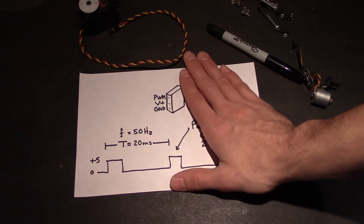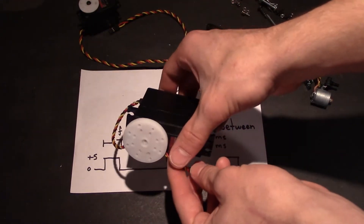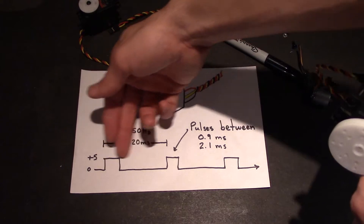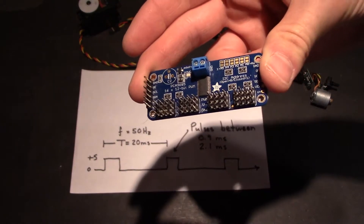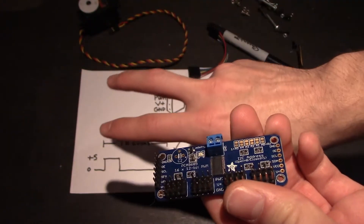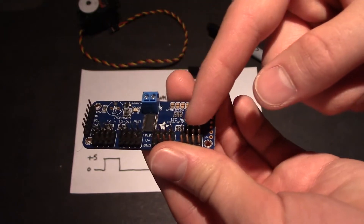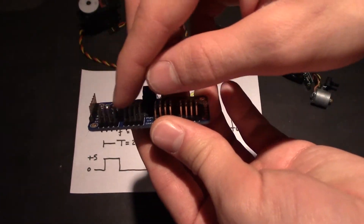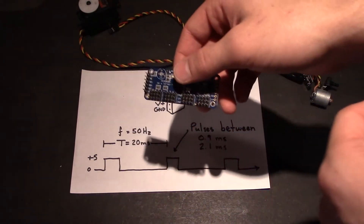The servos usually take 5 volts for sure, but some take more — bigger ones probably take more. This big one I used on my robot arm takes more than 5 volts; I think its maximum was maybe 6.4 volts, but it for sure took 5 volts. Which was handy because all our servos took 5 volts, had the same period for this pulse, and all had the same pulse width. That is the whole idea of standardization. Using this handy Adafruit breakout board for the PCA9685 — technically an LED driver — it's way better off driving servos because it outputs 16 PWM channels at 50 hertz. All our servos were programmed the same: 50 hertz and 0.9 to 2.1 millisecond pulses. Beautiful standardization.